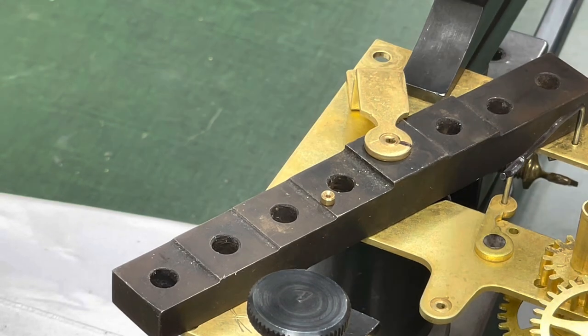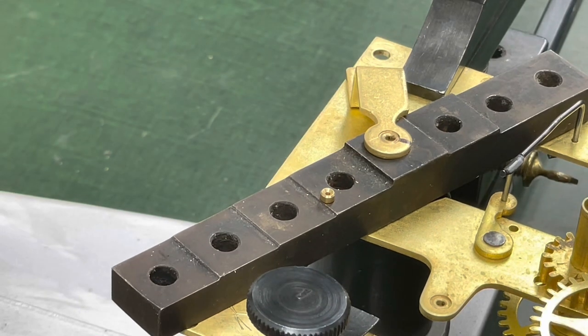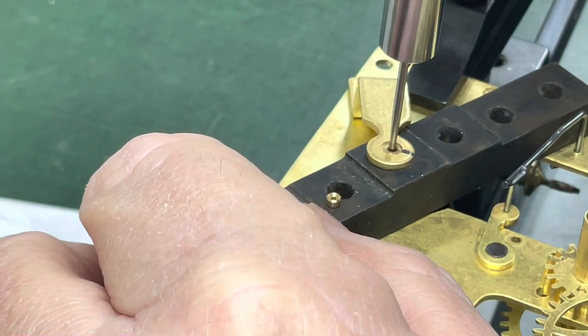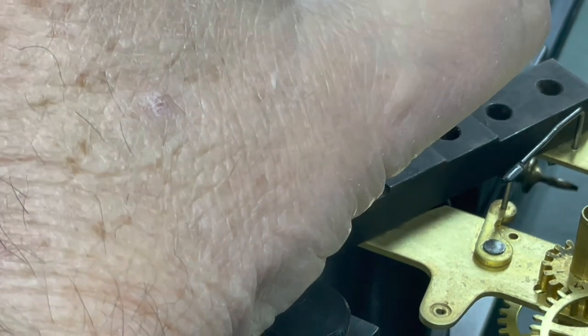Here's the 2.47. Go down here to the 1.97. I'll start cutting with that. I'll make sure that this bridge is underneath there. And I make sure that I'm pushing on this one. I have to push away from the wear. Make sure that I come in at the center. This is a really important one. This is a lot of wear on this.